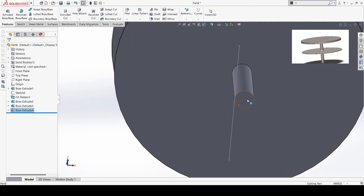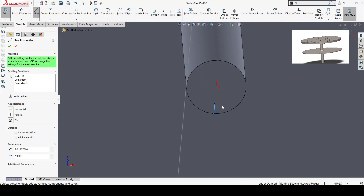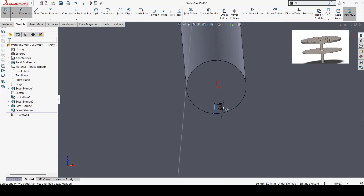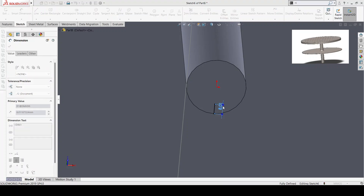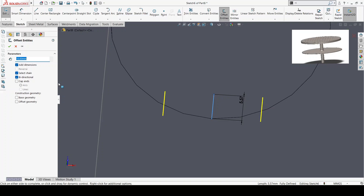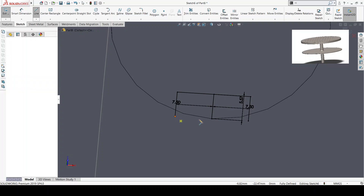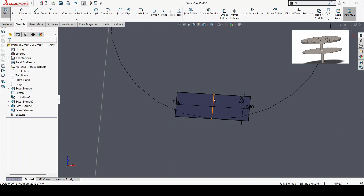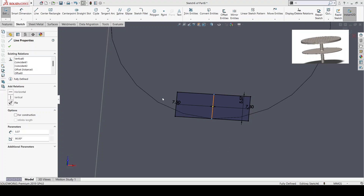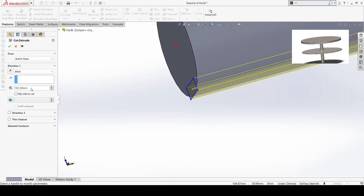Having reached this step, I'm going to do the key. The key measures 5.57. I'm going to offset it by 7.5 millimeters, then connect this line to that line, then this line to this line. Just delete that, then I'm going to extrude cut through 62 millimeters.